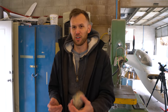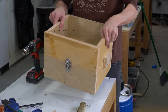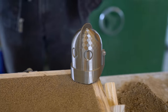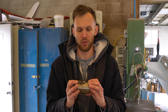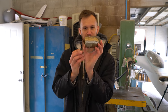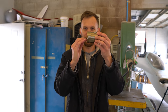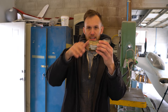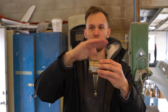Now I'm here with the guys from the channel Good and Basic. I'm going to try to use the sand casting boxes that I've just made. First thing I'm going to try is this Iron Giant head that Joseph 3D printed for me. This is not an ideal shape for sand casting — no matter what angle you have it at, there are at least some undercuts. The fewest undercuts are if we go this direction, where the only real undercut is the jaw. So what I'm going to try and do is sink this halfway in the sand, build more compacted sand up to the level of his jaw, and then carve it off at a nice slope. That way I should be able to separate the sand, get his face out, and build the other sand up over it.